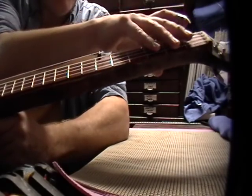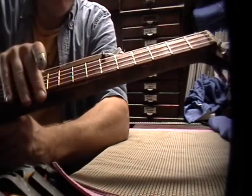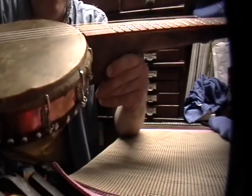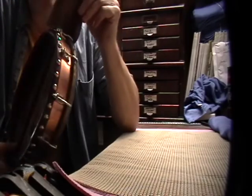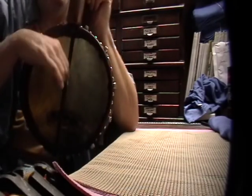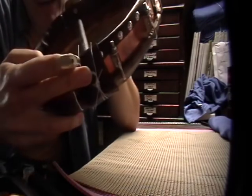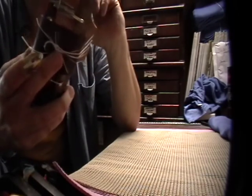I don't know if I hit it with the sander, but this end is a little bit lower than the middle. So I consequently had to file some frets down here. Getting the angle on the neck was a bit tricky. I went ahead and drilled a hole through the other side of the rim where the carbon fiber rod comes out, and that's where the strings are tied.